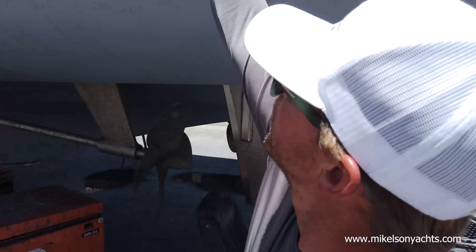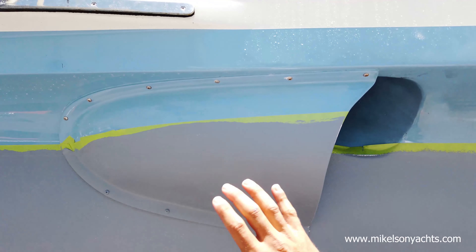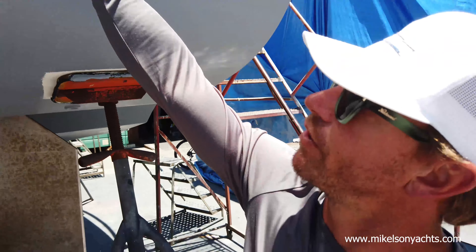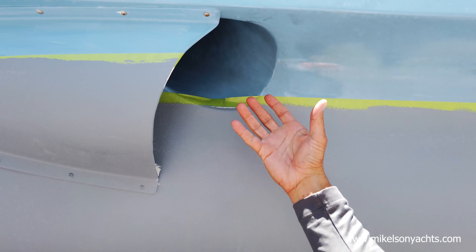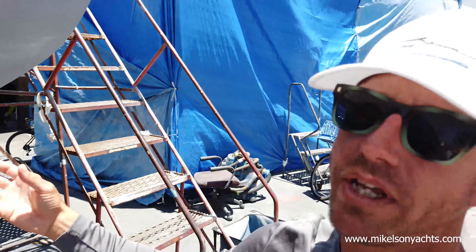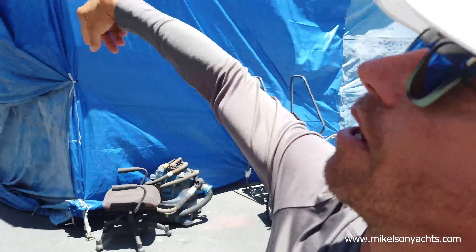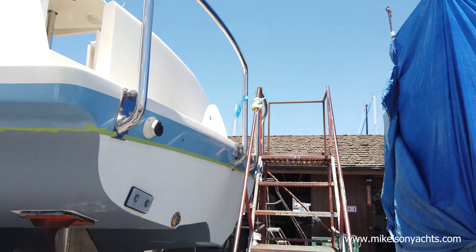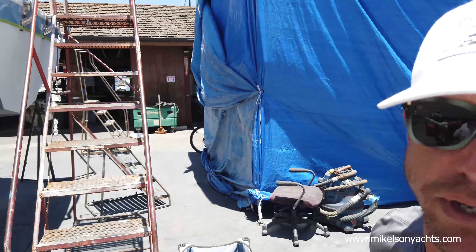Additionally, you can see this clamshell that diverts the water around the exhaust. When water hits that and wraps around the corner, it creates a vacuum — a low-pressure zone right there. So when you're moving through the water and water comes around this, it actually pulls a lot of that exhaust down. Whereas if you have it on the back end of the boat, it's all just coming out and the venturi or station wagon effect blows it back into the boat. But if it pulls underwater a little bit, by the time it surfaces the boat is past it and you don't get nearly as much.